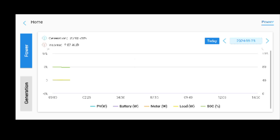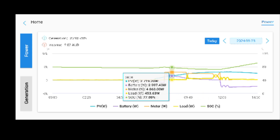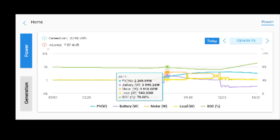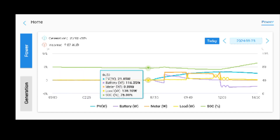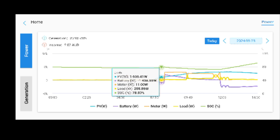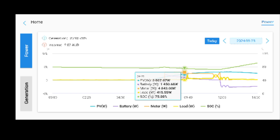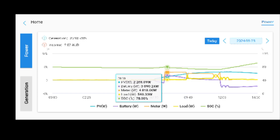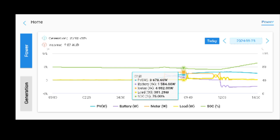On the screen here, you can see around 8am I've set it up so the battery does a full discharge into the grid to flatten it down a bit, because I keep coming to the end of the night with like 76% left after running the house overnight and charging cars. So from 8am it just goes full beans out into the grid. You can see the battery starts to taper off — that purple line — as the solar builds up, because I'm only allowed to export 5 kilowatts maximum. Then we hit lunchtime and the battery goes back into charge mode.